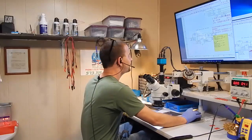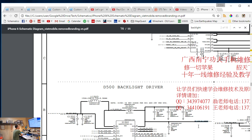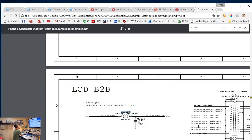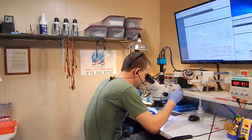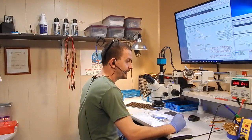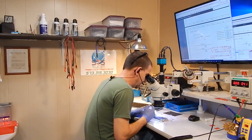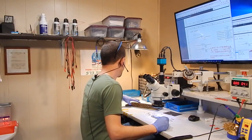Let's do something very important to this board. If we look up FL-2024 — that's the filter that's blown, the component that's missing. It was laying inside of the LCD connector — perfect place for it so it can re-short something. Remove the fuse and jab it into the LCD connector. Those people would have never known this because normal people don't look for things this small. Let me get you back to the microscope — I just added some flux where FL-2024 is supposed to be.